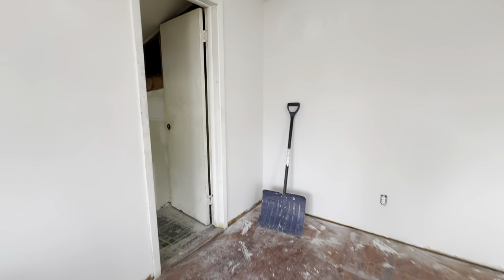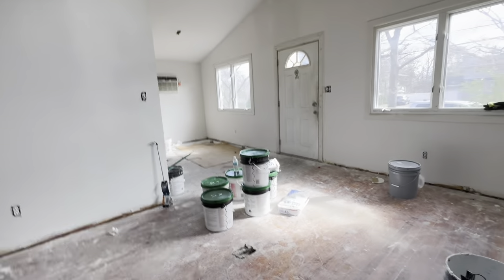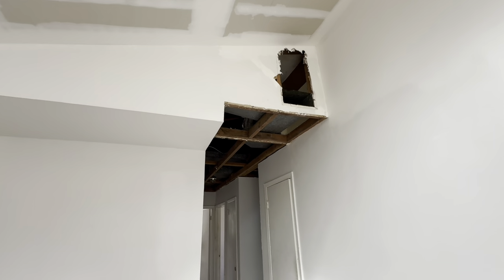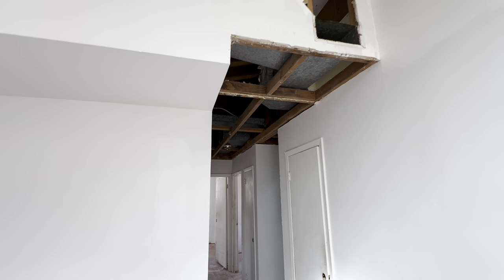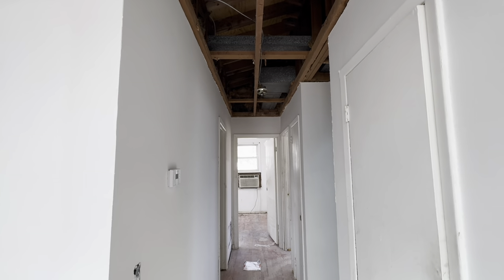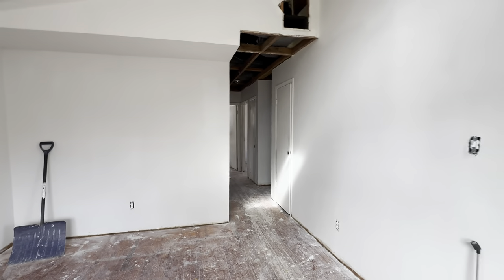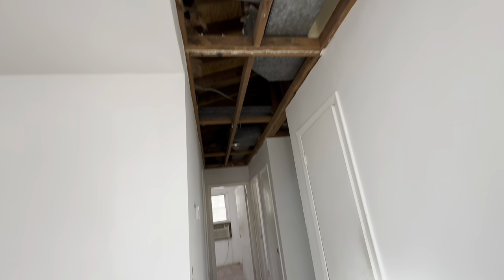This was the converted garage that I'm making into another bedroom. I wasn't getting any heat in here, so I had one of my guys open up the wall to check for disconnects in the vents. Followed all the ductwork and realized there need to be two runs from the main chute. Also remember: in these older houses none of the vents are going to be insulated. If you're keeping it as a rental, I'd insulate them — you can buy it at Home Depot and just wrap the main vents. It'll save you headaches down the road.